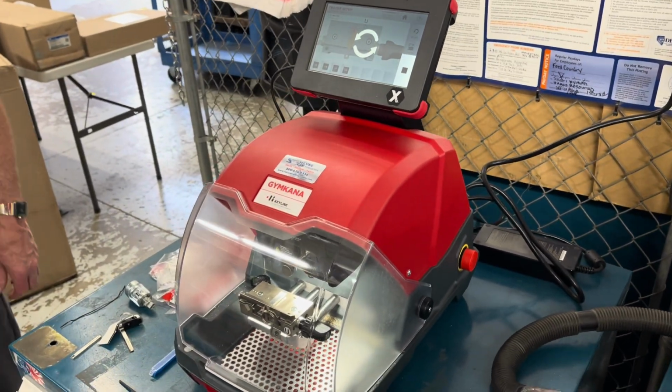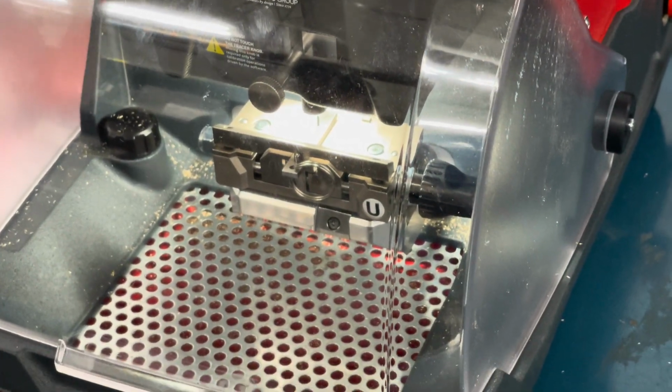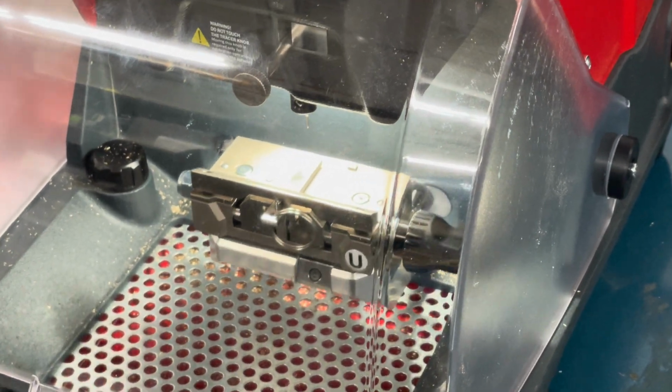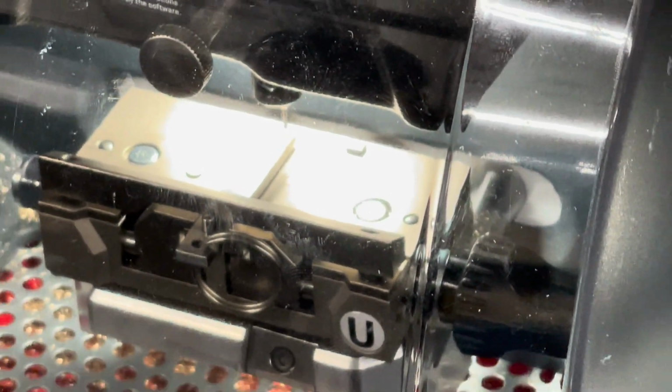Now it's going to move around and collect information. The reason the cutter had to come out is the cutter's got flutes in it. So when the cutter is touching the block, it could move. Even though it's symmetrical, you're not going to get a good reading. That's why that special tracer goes in. And then it will come out in about a minute.